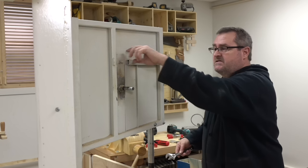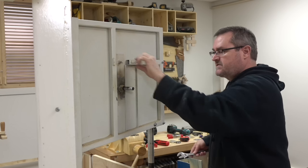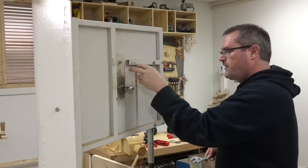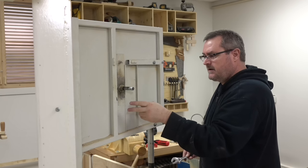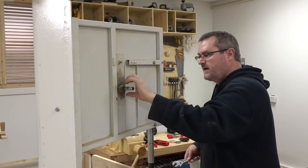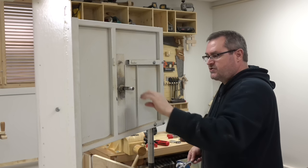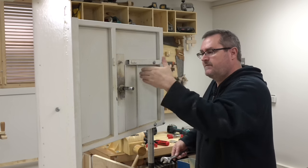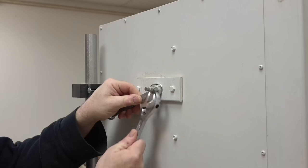This is a big piece of quarter-inch thick stainless steel that was very tough to weld, actually, because it's hard. And I've got just a bolt, a 5/8 inch bolt, welded right onto that. And that's the shaft for that wheel. It's strong, but the adjustment is really flaky.